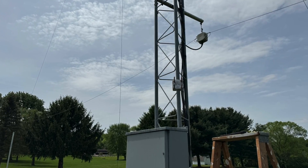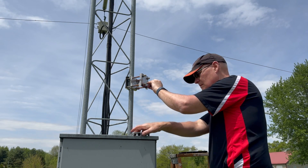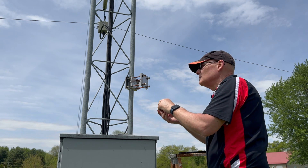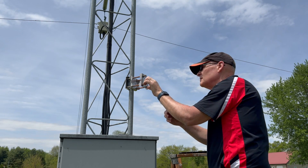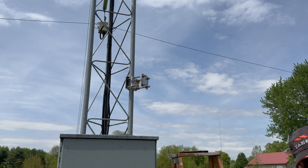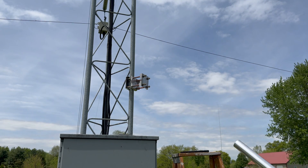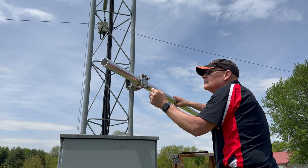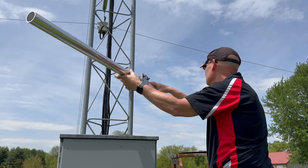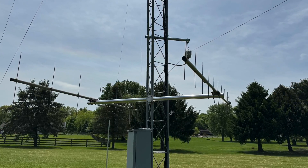The third configuration is the mast mount. Installing a clamp on a mast with a horizontal pipe or tube will allow you to mount VHF or UHF Yagi antennas, either in a stack configuration or as just two separate bands — a great way to maximize your mast space for multiple antennas. I start by mounting a single DXE-SSGC2P clamp to the mast. For this demonstration, I'm side mounting this to the leg of my tower. I loosely fit the outside piece of the clamp, slide the pipe or tube through, then install the antennas. Once everything is centered, in place, and level, I tighten the hardware.